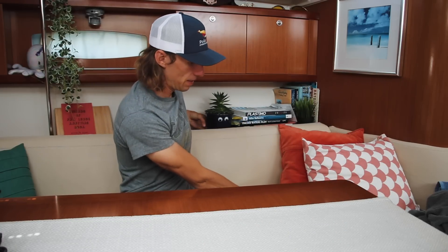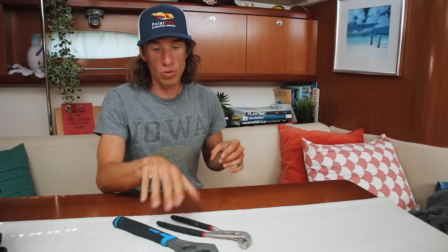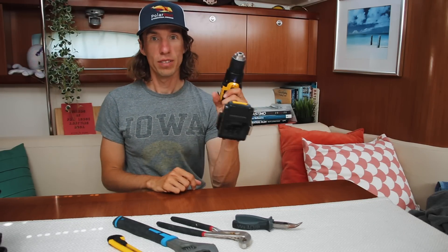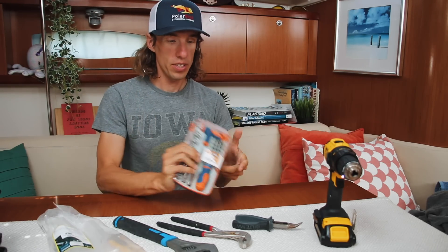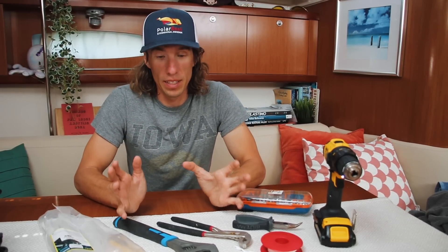So you've got all your parts and now you're ready to install your water maker. Before you do, here are some of the tools I found most useful: an adjustable wrench and an adjustable plumber's wrench — having two is really helpful — some pliers, a good knife, a drill, zip ties to hold things in place, a screwdriver set, and lots and lots of plumber's tape. It's not an exhaustive list, but these are the tools I used probably 90% of the time during the installation.